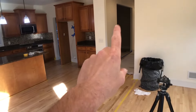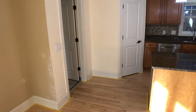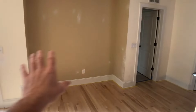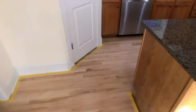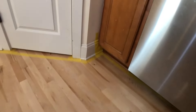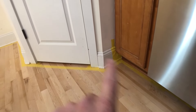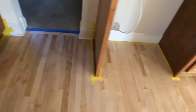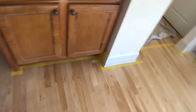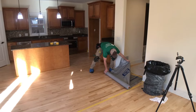Everything's lined out around our edges. The dust barrier wall is going to go right along this floor line. We're going to put a zipper wall in right here and cover that doorway completely. Over here we have a utility sink we want access to since we're painting all the walls. Where the base trim meets the cabinet, we're masking it up and getting it tight — we'll take some paper and mask that too so we don't get overspray on it. Under the oven is masked off. Now we can go ahead and get our Grip-Rite down.